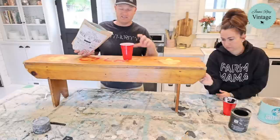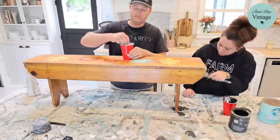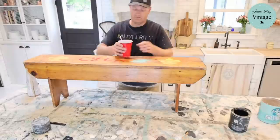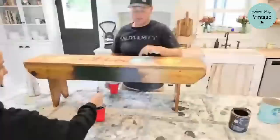I'm just brushing the salt wash on — you can stipple it if you want to add texture, but I'm just brushing. I might come back and do some thicker texture in a few areas, but I'm trying to get an all-over textured finish. When you have old paint finishes, generally at some point somebody got some crud in their paint and you got texture. So when you try to make something look old without a textured finish, salt wash helps out. If the mix is really thick you could stipple it, but I don't want it overly textured today.